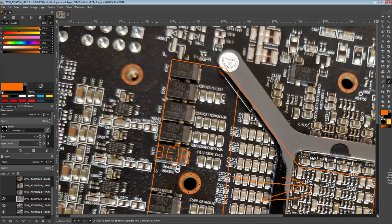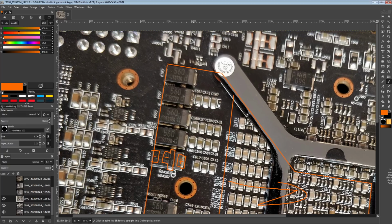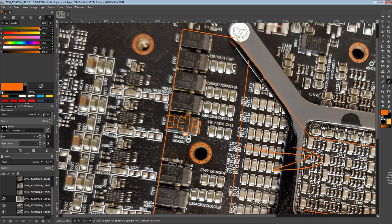Anyway, so lower endurance, but much electrically superior. That's the cool thing about these. And then we also get the multi-layer ceramics over here, which are basically more of the same as these, except they come in even lower capacitances relative to how big they are. So those get expensive as well, because you need a ton of multi-layer ceramics to get even close to 560 microfarads. The largest capacitance you can get in this package size that I'm aware of is 47 microfarads, assuming you're not buying them in some really low temperature rating, which you wouldn't use because this needs to be near the VRM, and VRMs tend to run a bit hot.